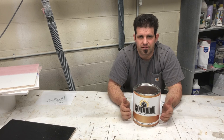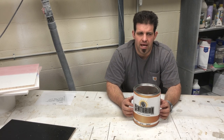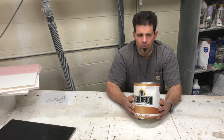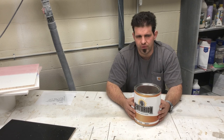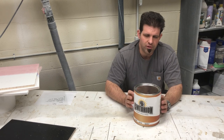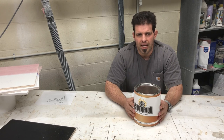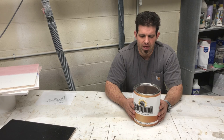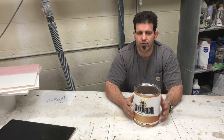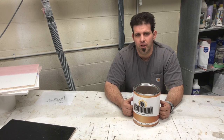The other thing I like is the speed — 20 minutes and you're ready to scuff and put your top coat on. I like the CIC best for in-house kitchen work; the smell is less and it has a lower VOC at 275. I still use the Exalta from time to time, but I'm really giving the CIC a go. We proved that removing HAPs doesn't make it worse than higher-VOC products.